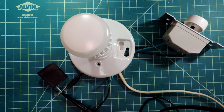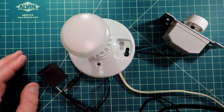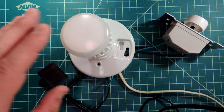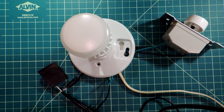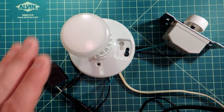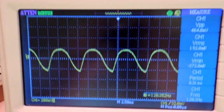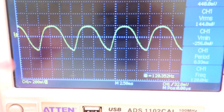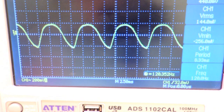This is the flicker test. Some people are very sensitive to these light bulbs — they can produce flicker if they don't have adequate filtering capacitors on their output stage. A very simple setup to gauge how this bulb compares to others: a solar cell generates electricity proportional to the light that falls on it, the bulb is in a socket, and on the oscilloscope it produces a waveform. It's usually around 120 hertz — we measure the volts peak to peak and do that for each subsequent bulb to get a sense of how the flicker varies.